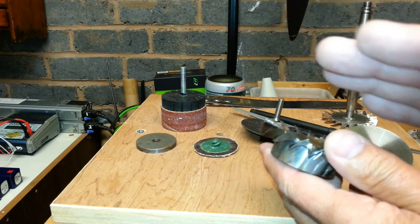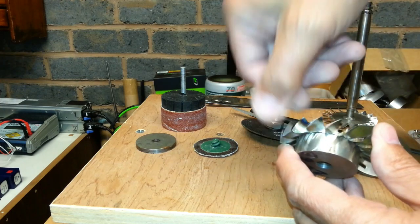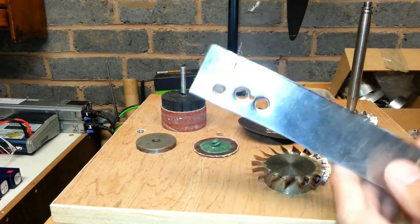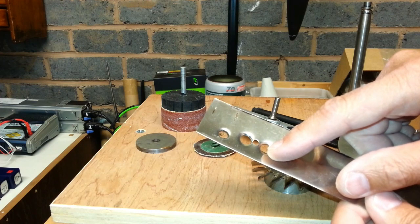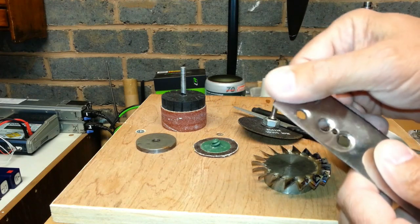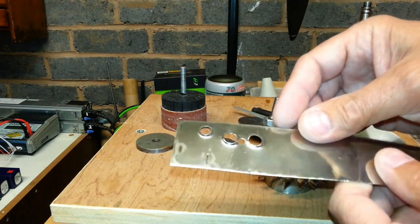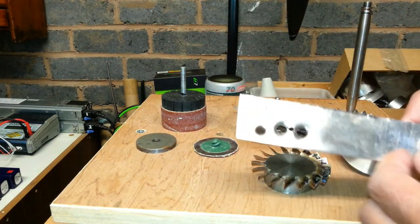At the moment they look like they're even coming up, but they want to be twisted back again, and that should lower your temperature. I also tried swaging the two 7.5mm holes - you can do it, but it gets very close. I drilled them 6.5mm and swaged them out to 7.5mm. Doing it 7mm then swaging to 7.5mm might be better. But you've got to be quite accurate with your holes because everything's that close on the perforated wheels - it's nearly going to cut through.